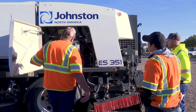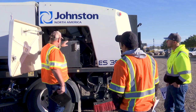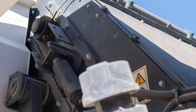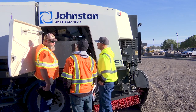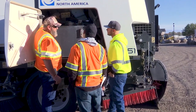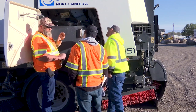Under this access right here is where you've got your hydraulic reservoir that powers the equipment. You've got a level right here, plus a temperature gauge and your filter. What you've got is a ram right here connected to a drive axle that's up on top. On the bottom, this right here is a high pressure button head greaser — you need a special adapter to run this. Once you get that adapter on a grease gun, remember what I told you about 3 inches? This is where you adjust it. Pump this full of grease, it'll extend that ram, push that axle up, and tighten your chains.